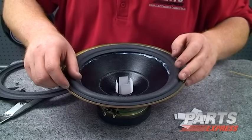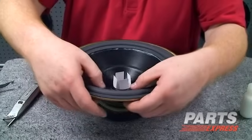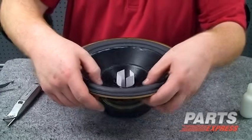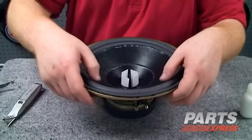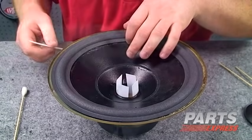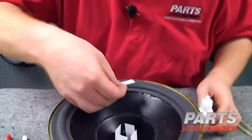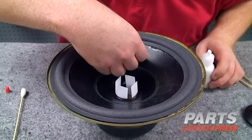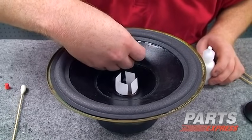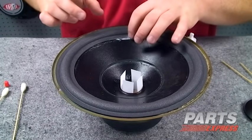If your layer is thin, it shouldn't take very long at all. As the glue holding the foam to the cone dries, we want to go around and make sure that it's not lifting up and that there's no bubbles or irregularities developing. Once you're sure you don't have any areas that are going to lift up, I suggest walking away from it for 15 minutes and letting the glue set up a little bit. We stepped out for a minute and had a nice hearty lunch, came back, and the glue is dry around the inner edge of the foam. Despite our best efforts, you can see that it didn't quite adhere very well here, so the first step is going to be to get that taken care of. We're going to apply a little bit of glue to one of the unused shims and spread that glue around on the inner edge of the foam, being careful not to get too much on the cone. We're going to hold this until it's fairly tacky and the glue is going to hold on its own.